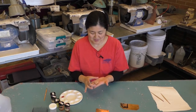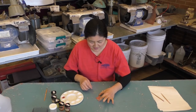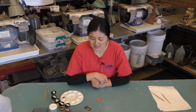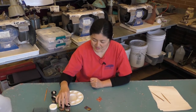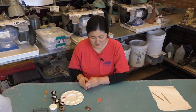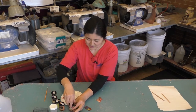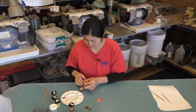Make sure you don't touch the area you want to enamel. I have a few enamels out here that I'll be packing inside this area. Because the base metal is copper, clear or transparent enamel will not really show well. So everything I picked is opaque enamel. If you want to use transparent enamel, you might have to apply white first and then do the color, or you can use a silver foil on the ground — but again, that's more process involved.